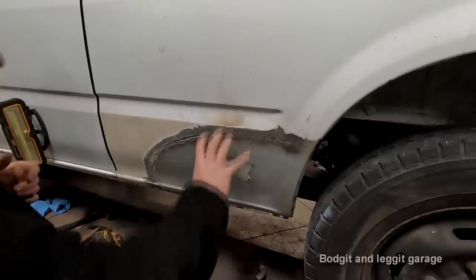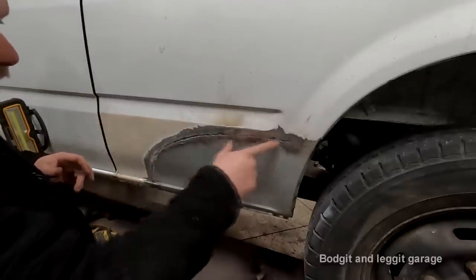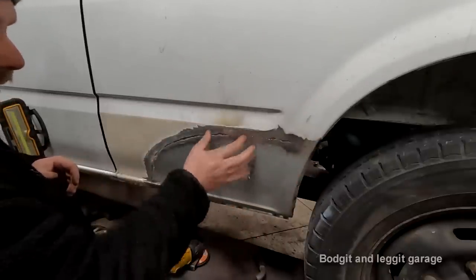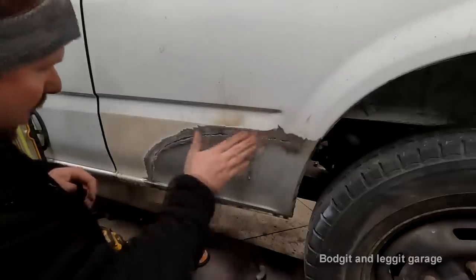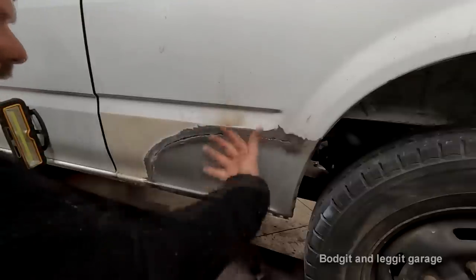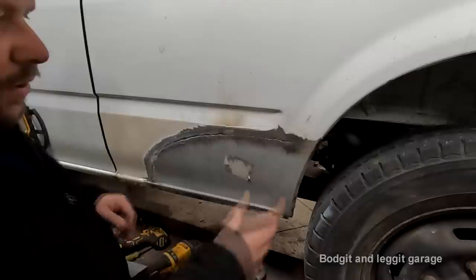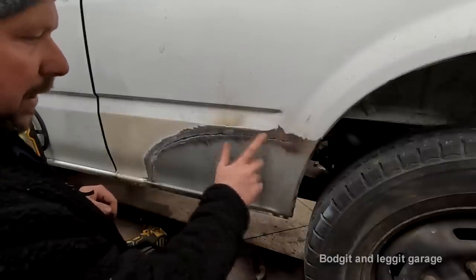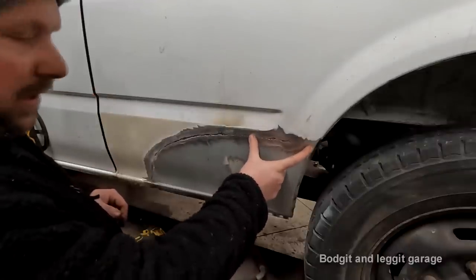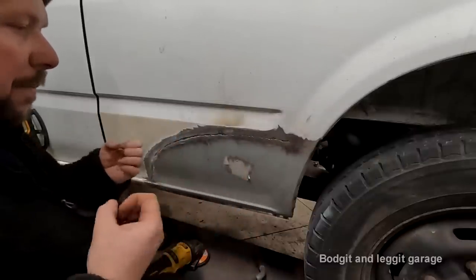Because the metal expands and contracts in different temperatures, and because this is a lot thicker, this weld mark is going to be a lot stronger than any other panel around because there's more metal there. And we've actually tempered it now because we've heated it up. So if you really want to do this properly, but you'll never get paid for it in this instance, you need to TIG that. When you're spot welding, you're just putting little spots. When you're TIGing, you'll mostly TIG 5 or 6 inches at a time, putting a lot of heat in. But TIG is very pliable.